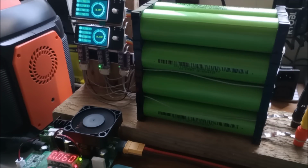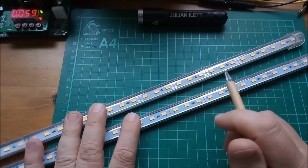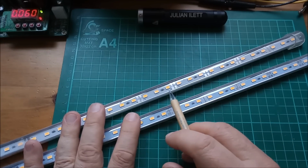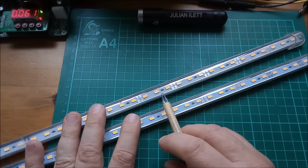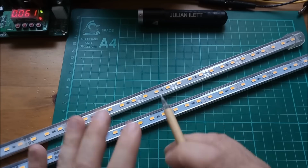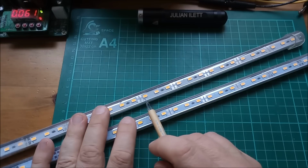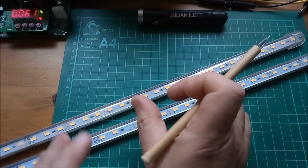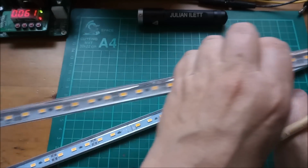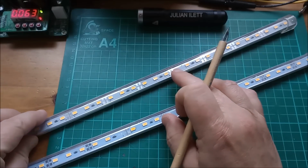Interesting. Now in the shed, I have predominantly got these strip lights, and they're just multiples of these little circuits, which are 3 white LEDs in series and a series resistor which says 390, and I once erroneously called that 390 ohms. Of course it isn't, it's 39 ohms. So 39 ohms, 3 white LEDs in series, and then that cluster is just repeated, paralleled up all the way down the strip, and at one end you've just got a couple of wires coming out to hook these lights up to your voltage source.